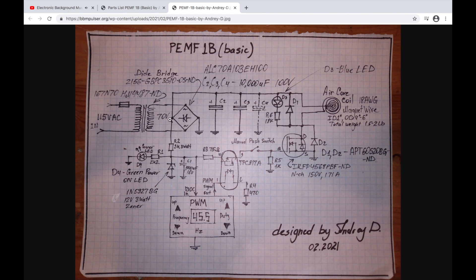The positive comes out and goes into the capacitor bank, which consists of two or three capacitors. These capacitors are 10,000 microfarad, 100-volt each — they cost about $12 apiece and are not expensive. You can use between one and four or five of them. The more capacitors you add, the more stable your circuit will be. I'm showing two as standard with an optional third — you can make it permanent or use just one. More capacitors means more stability.